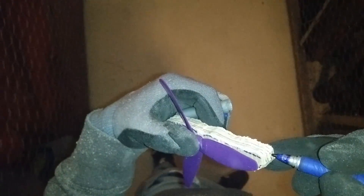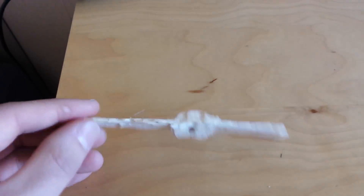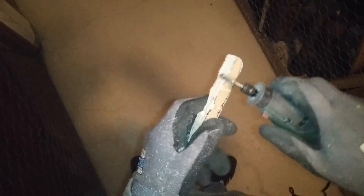Now I'm marking out how I will cut the wood and at what angles so it will be the correct angles. Here's a propeller I made first, which doesn't have good angles — as you can see, this piece of wood won't fly anywhere. It was also a bit thick, so I made it thinner so the nut could get some threads. Now I'm starting to shape the propeller so it can give some thrust. As I said, plywood is not so good — here a lot of pieces came off, so it wasn't a perfect propeller.